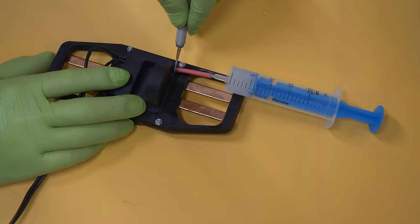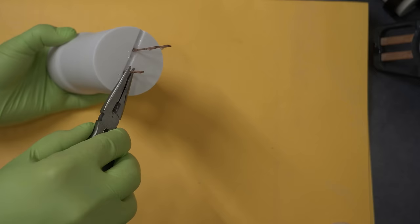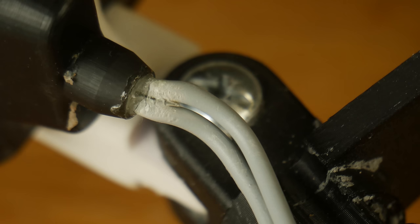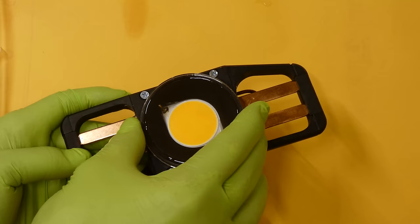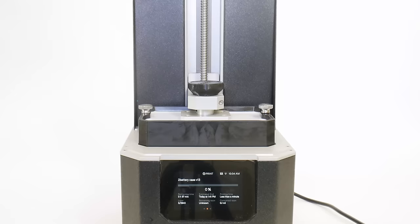This proved to be the perfect watertight seal for the wiring. Alternatively, you can use epoxy glue or superglue as we did with the battery case — the key is to fill the channel to prevent any water leakage. A flexible silicone seal also protects the wire insulation from cracking. Finally, we glued the plexiglass cover with epoxy resin and secured it with a 3D printed cover. It turns out that this hadn't been the best idea, but we'll get to that in a minute.